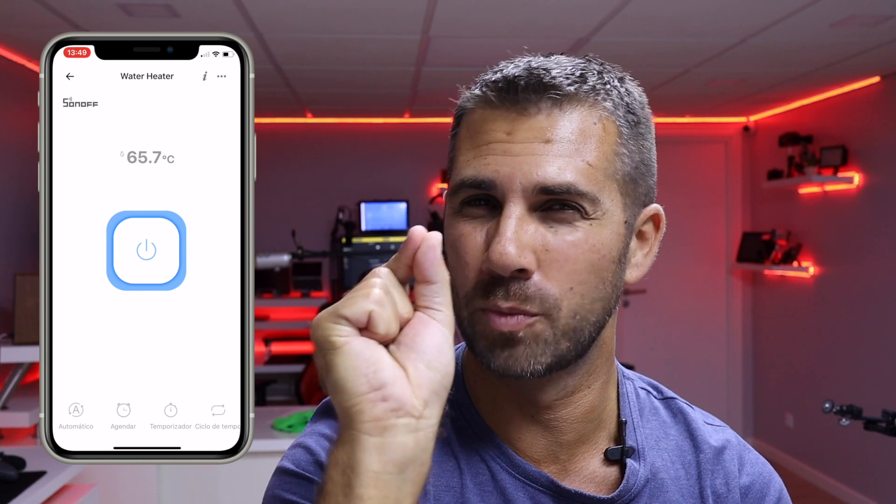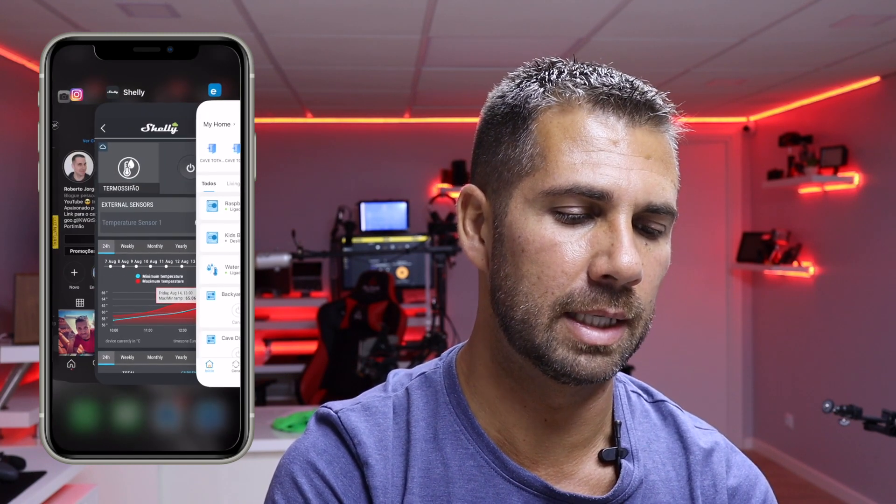The experience I'm doing at this moment — as you can see, I already had one solution to measure temperature, which was the Sonoff TH16, and it's been giving me great results. Comparing right now with the Shelly, the readings are more or less the same. The difference is just because I've got one probe on a different side — we're talking about less than one degree: 66.69°C vs 66.3°C. The Sonoff app has to refresh manually while Shelly updates automatically.